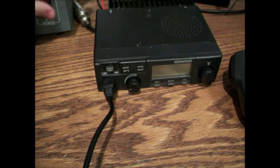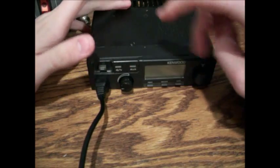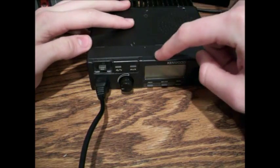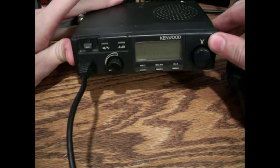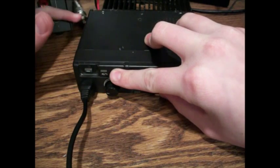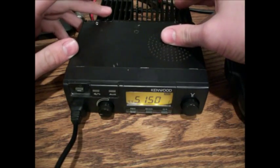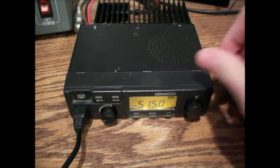I'm going to turn on the power supply and just give it a second to warm up. Now, to program it, you're going to want to start off by putting your fingers on the aux button and the D/A button — it's right in the corner. So you're going to want to hold those both down and you're going to turn it on. Hold it until you hear that beeping noise — that means you're in the programming mode, so that you can set the frequencies.